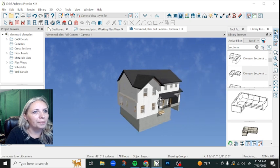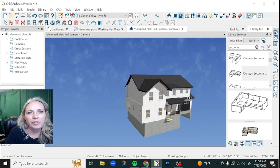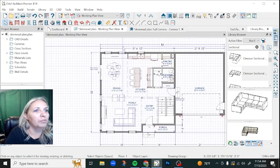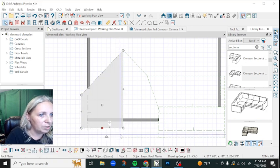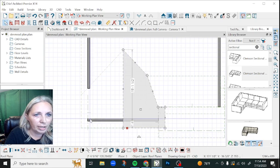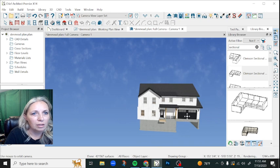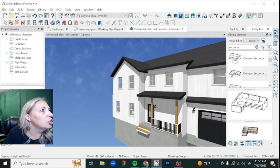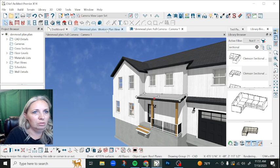So pretty straightforward. Up here, this gable we're just going to shorten by two feet. This little roof overhang for the porch — shorten by two feet. And then we're just going to add a little shed roof section, similar to what's on top of the garage here on this new little side section, since we did not extend the upstairs when we extended the downstairs. I always keep my roofs on the attic level. So instead of three foot six, that needs to be one foot six. And then on this one, same deal. Looking at the 3D, when I shortened this one, it got the baseline mixed up. So we actually want to drop the baseline — that brings it back down to where it should be.